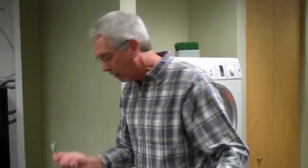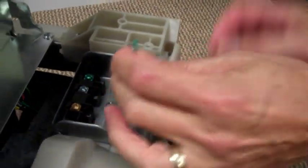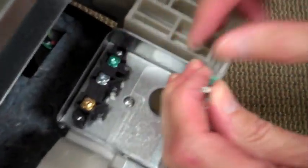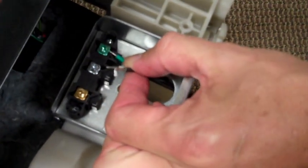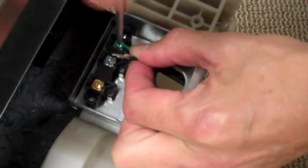With the pre-stripped cord, go through the back of the junction box like so. You will see a green tip screw, a silver screw, and a gold one. The green wire goes under the green screw — simply take your screwdriver and tighten it down.